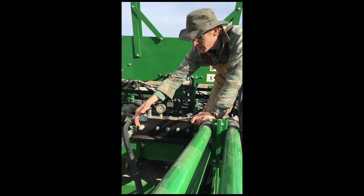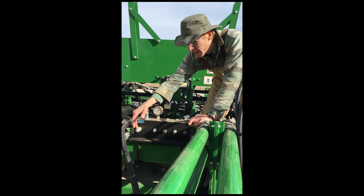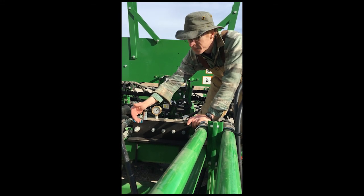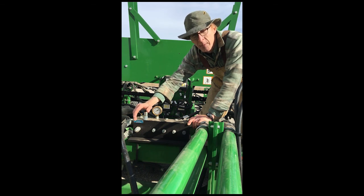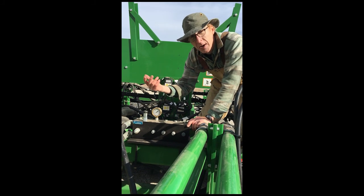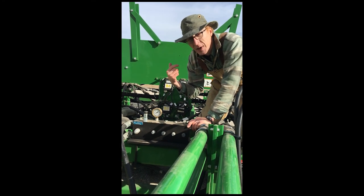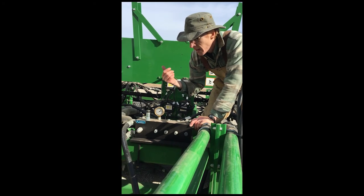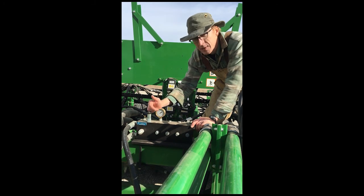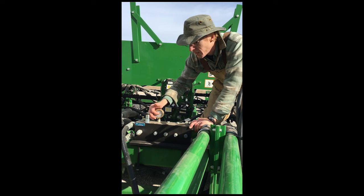Originally, we tried doing some fancy things with sequencing valves and so forth. What we've settled on is reducing some of that complexity. It was unnecessary. Now we just leave pressure on the UniForce cylinders all the time. That presents no problem whatsoever from wear or taxing the tractor, and it simplifies the system greatly. So our cylinders have pressure on them all the time, raised or lowered, and the rock shaft does the raising and lowering. So what you originally adjusted for pressure on the rock shaft, you now do with this valve and watching this gauge on ours.